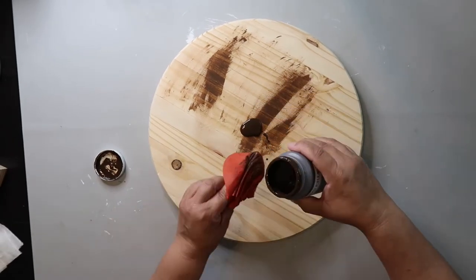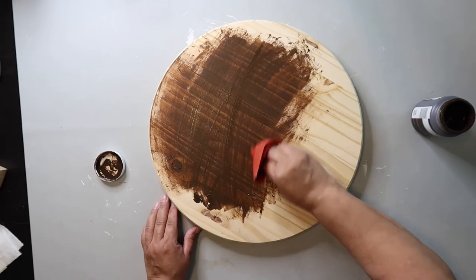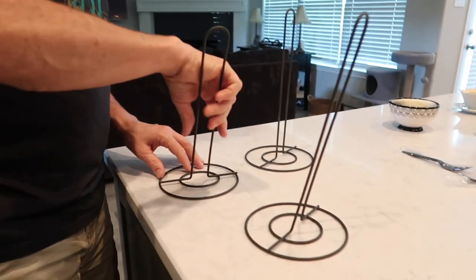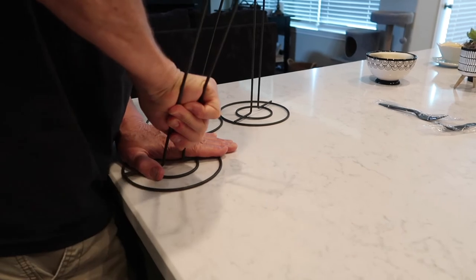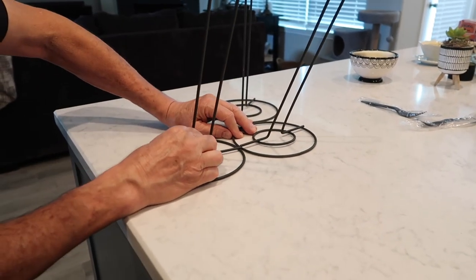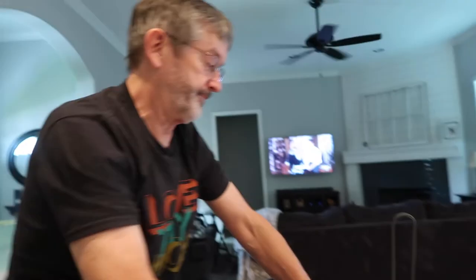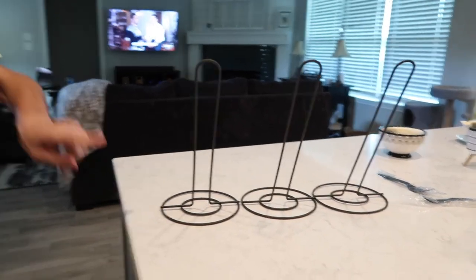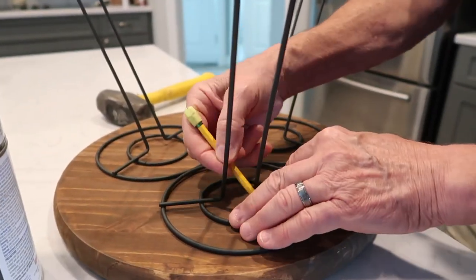That's really all you need besides the Waverly wax in antique for staining. I still haven't quite got the staining thing down yet, but I'm trying. To prep the legs, I used some sandpaper to roughen them up and take some of the shine off. Then I took them outside and spray painted them with Rust-Oleum's ultra-matte paint in charcoal — it's like Rust-Oleum's chalk paint but in a spray can.